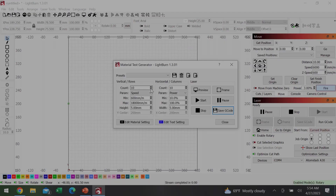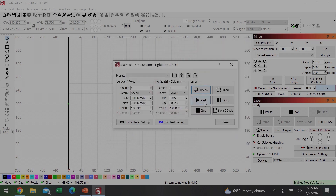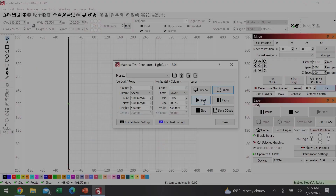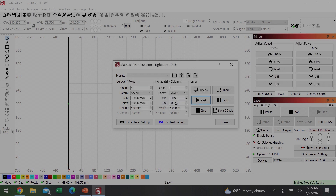I decided to run a quick materials test to see if it would work on cylinders. This is a good way to find your optimum speed and power settings for your machine and the material you're engraving. In this case I'm burning automotive primer off an aluminum can — barely anything would do it. After verifying my framing, I was ready to run the test. One thing I noticed when doing rotary with Lightburn is I always got a little warning — I think this is because the Y axis has no limit switch. Just click continue and you'll be fine.